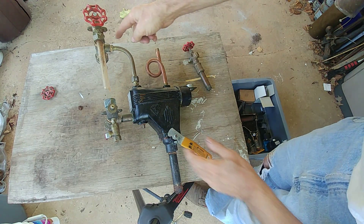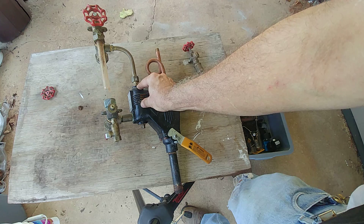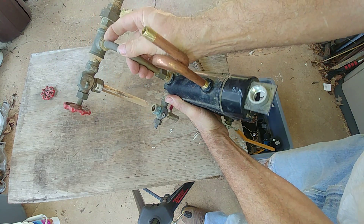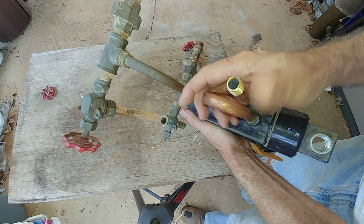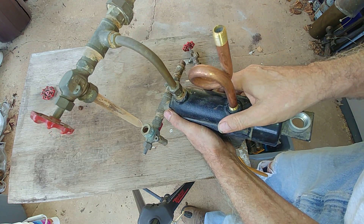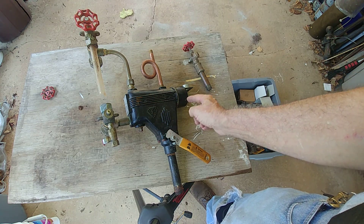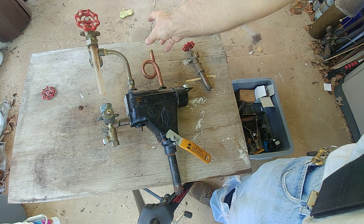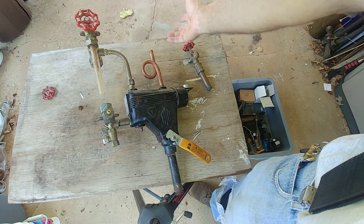This is a half-inch outside diameter tube that hooks on to a compression fitting by a half-inch male adapter. This is a unique OEM fitting — a sort of compression tee — which very often leaks right there. Some of them get that alignment correctly, but usually after a couple of years you'll see a lot of corrosion on that. The rest of the body is iron. Here is where you have your pigtail, or steam siphon, which is protecting the pressure trol, usually mounted somewhere up here with a tee and a pressure gauge.